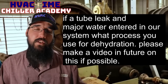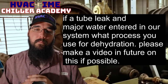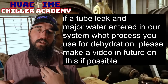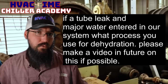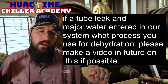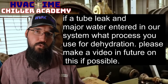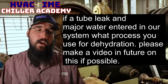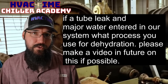Let's say this happened at a very small scale and you had that tube leak and it wasn't severe. But you did say major water leak, so we're talking major — you're talking a retube and probably an overhaul. But for everybody else, once you plug the tube and you've got a low-pressure, it means you've got water in the system now. You're going to want to do a recovery and try to clean that refrigerant.